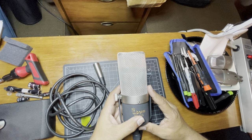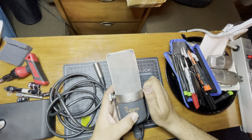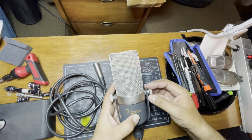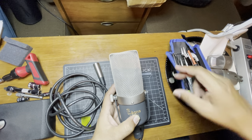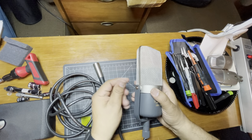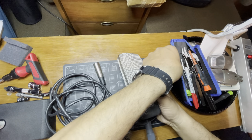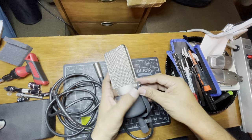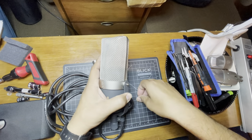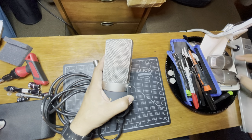The trick on these mics is to get the tension right and make sure that after you've set it up the ribbon is not touching the magnets. We're going to take this apart — just take off these little side nuts or bolts. There's a little washer there, so don't want to lose that. Always have a little spot where you can keep your parts.